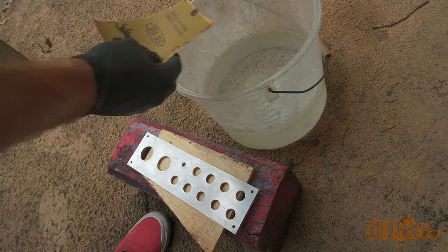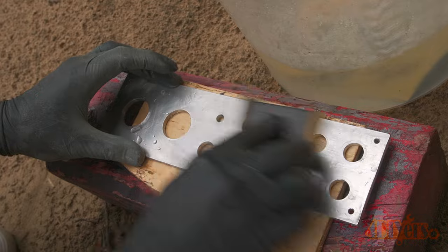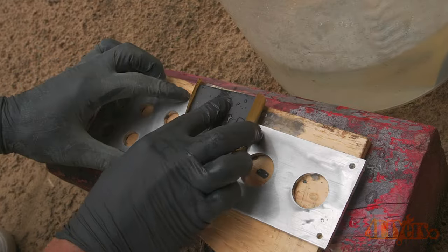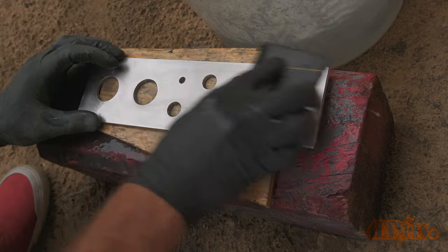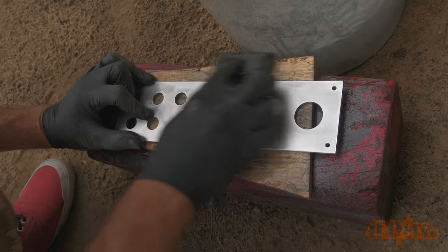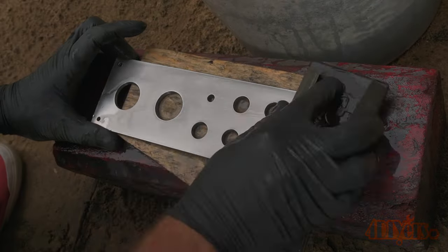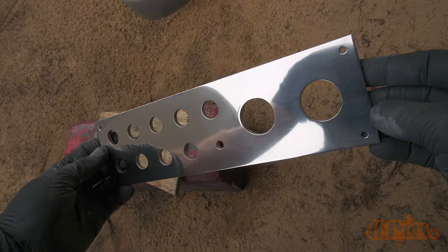For polishing the panel, I have a bucket of water. The panel has been cleaned to remove any contaminants which may cause surface imperfections during polishing. I'm using wet-dry compatible sandpaper, and the part is wetted for lubrication and to keep dust down. With this being a flat surface a backing pad is used. Start with 800 grit first, working evenly across the surface. With 800 grit almost all surface imperfections should be removed, then move up to 1000 grit. Always keep rinsing the part and sandpaper to remove debris. Next is 1500 grit, then 2000 grit, and finally 3000 grit before moving to polishing compound. I'm using an aluminum polish with a soft cloth worked into the surface.